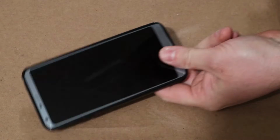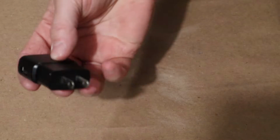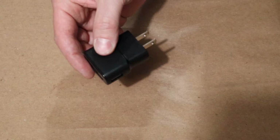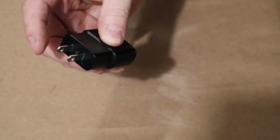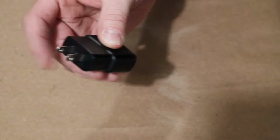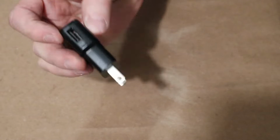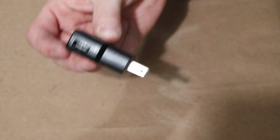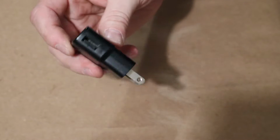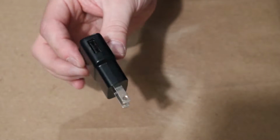So what's an example of a step-down transformer that we use almost every single day? Well, every single day I gotta charge this thing, well actually probably even almost twice a day, so I need to get my little USB charger. And this is a step-down transformer. We're taking our 120 volt AC coming from our outlets in our houses, and we are converting it to USB power, which is 5 volts DC. So not only are we stepping down the voltage through the step-down transformer, we're actually converting it as well. We're turning AC into DC, but that's for a whole other video.